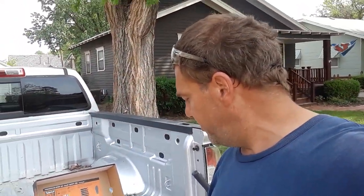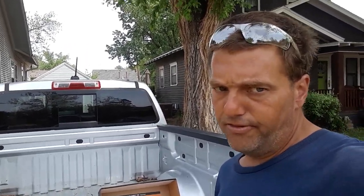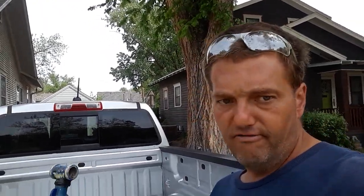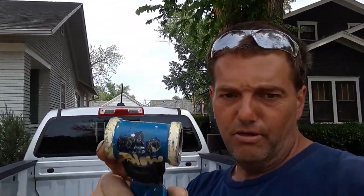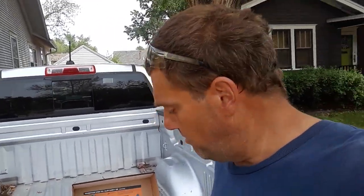For five bucks you can have a power washer. But I didn't want something that might be dangerous in my shop, so I had to think further. What I came up with was a tee fitting where I put air in the back and water on the bottom. On my original one I used a three-quarter inch to quarter-inch reducer for the air, but the problem is whenever that air blows across the hole the water is coming out of, it acts as a valve and shuts it off — the water surges and just doesn't work right.